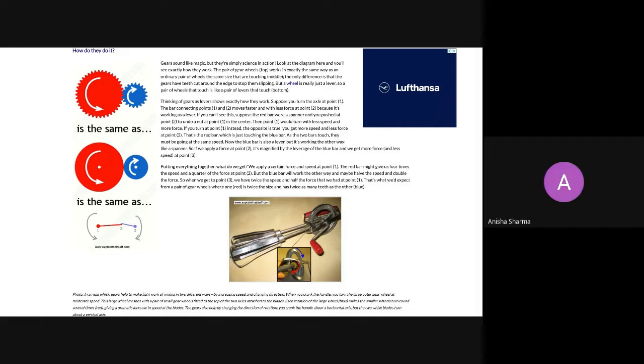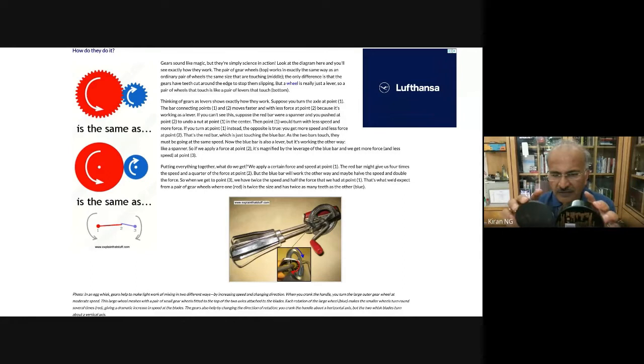So that means if I don't have the teeth here, then sometimes it will turn the other disc, sometimes it will not, depending on which is harder. Whereas, imagine if I have teeth on both, like the example of the first one. Then, whether you hold it tight or not, it will attempt to turn it until one of them breaks. If you turn it so hard, the teeth or the gear should break. Assuming both are strong, it will ensure that it turns. Okay, this answers the question, power transmission.